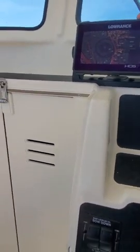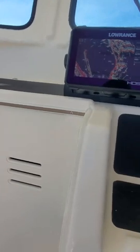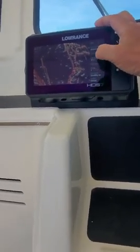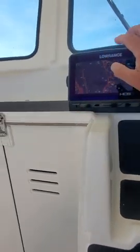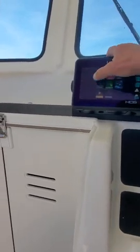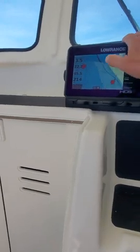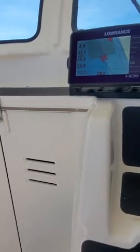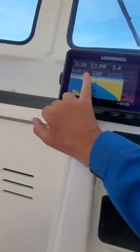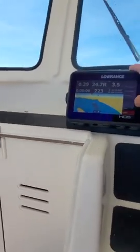For right now I'm going to go into adjust back view and turn off the target trail — that gets rid of that white until you get used to it. Go back and go into side scan — I had depth scan navigation. I'm going to set a waypoint right here, then go back into steer. That'll give you your time to destination, how much you're off on your steering — you need to go 15 feet to the right — speed over ground, time to destination, course over ground, latitude and longitude. Go like that to get rid of that bar.